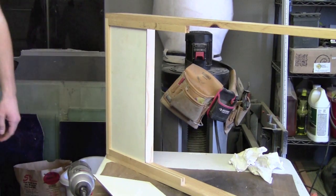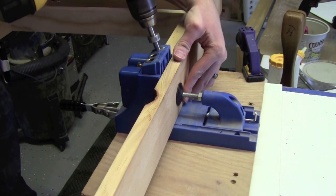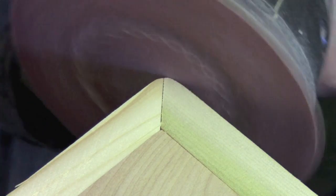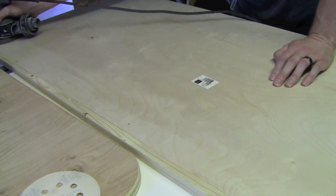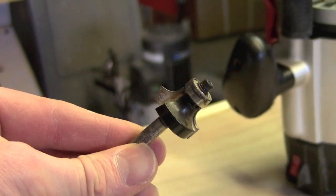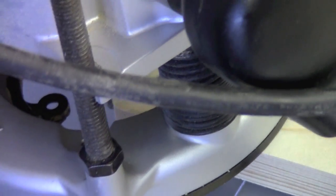Now I have a door to keep all the bags in place. We're just going to make some pocket screws along the apron so we can attach it to the top. Before we attach the apron to the top we just need to make sure that all of the edge banding is sanded smooth and flush.